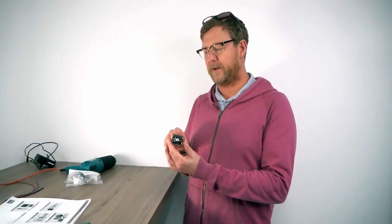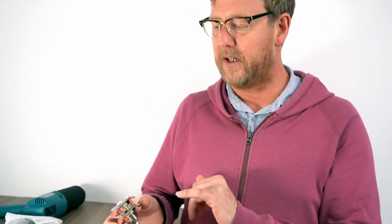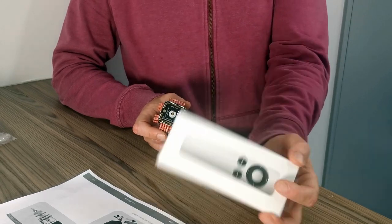Today we are going to be installing the Elma Audio Plus remote to one of these babies. So this is a stepped attenuator, it's a 10K shunt version. The way it works is you have a motor part that sits on the back and with the controller board, you have to program it, so we use the Apple remote with it. Effectively the Elma Audio Plus can be used with a 2-pole, 24-way, 4-pole, 24-way, 1-pole, 24-way, 1-pole, 47-way, 2-pole, and 4-pole, 47-way.